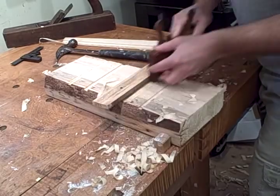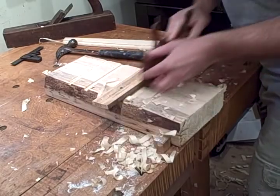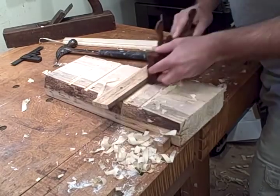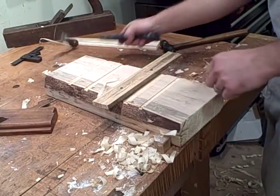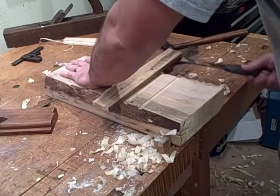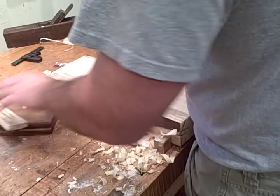These are really tight little curls of wood — it's a lot of fun to use these wooden dados. They work very fast. If you're doing a short job they're a lot quicker than getting a plunge router set up with a bit and fence and everything.